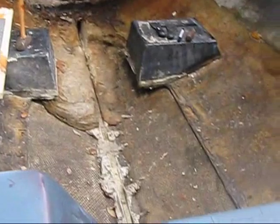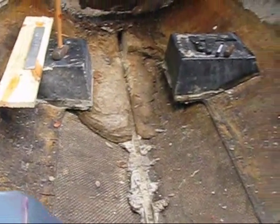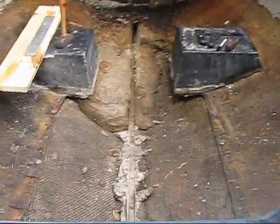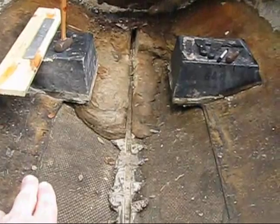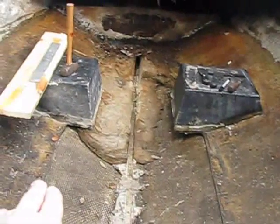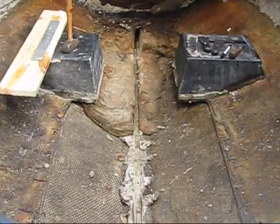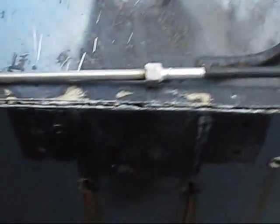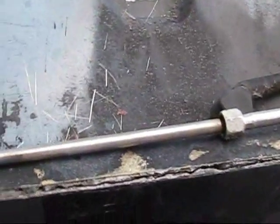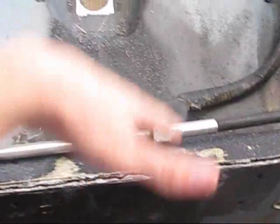What we're going to do today is lay down the stringer in that groove there, and soon we'll be putting the floor in. The floor just goes across those little areas right there, and we're going to get some pressure-treated plywood and lay that down. We've also got to redo the seat boxes, and then we've got to redo the transom here with some C-Cast we're thinking about using. You just pour it in the transom, and it fills up and hardens, and you're good to go.